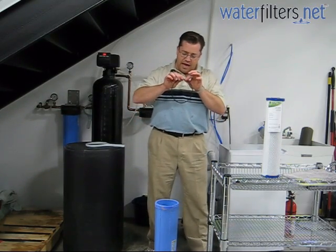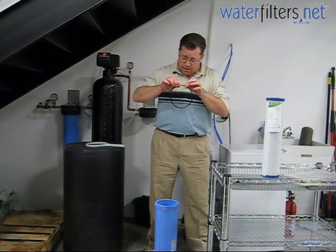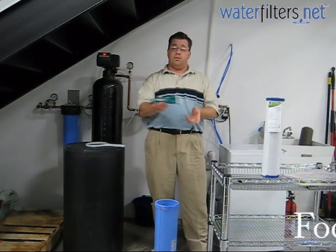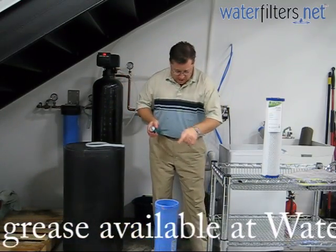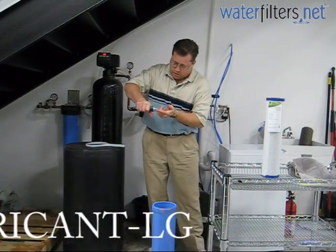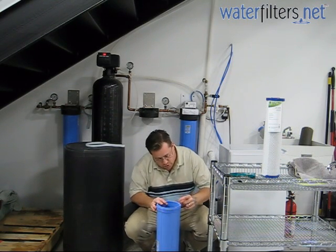Next, got to check the o-ring. Take the time to do this right — you'll regret it if you don't. If you put it back together and your o-ring is damaged, you're going to spring a leak, and that's no fun for anybody. Check it for flat spots, abrasions, dings, nicks. Looks pretty good. Now I'm going to re-lubricate the o-ring with food grade silicone grease, available at waterfilters.net. Don't use any other lubricant — only food grade silicone grease. I'm going to take a towel and clean out the groove that the o-ring seats into, then put some of this lubricant in the groove that the o-ring will seat into on this sump.